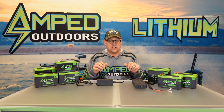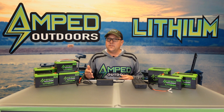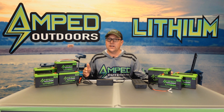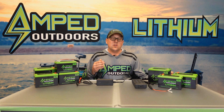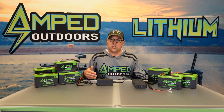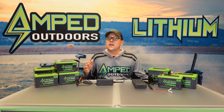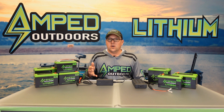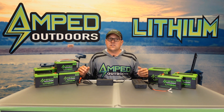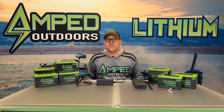Be aware that with these chargers, yes they will get warm — you are converting voltage and they will get a little warm. We have a safety feature built in so that if they get to a certain temperature they'll decrease the amount of amperage output to cool the charger down. You may also notice it sometimes takes a little longer to charge; for example, a 3 amp charger charging a 30 amp hour battery taking more than 10 hours is just fine. Towards the end of the charge process, all of our chargers ramp down the amperage going to the battery, which allows proper cell balancing and really extends the life expectancy of the battery.